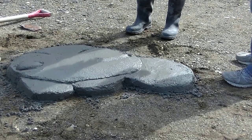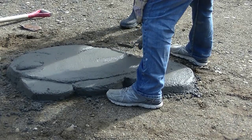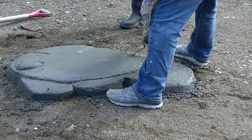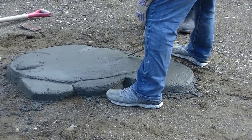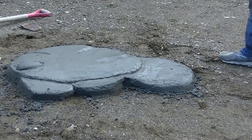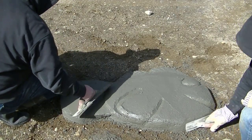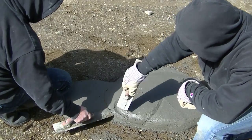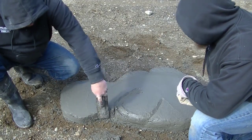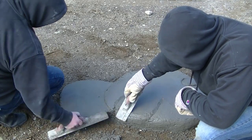They've got quite a bit of time — it's not that warm out today. It was probably in the 50s when they were doing this, so the concrete wasn't drying too fast. They had a good hour to really play with this before it got too dry. They're trying to figure out how to make it look real and add some highlights to make it look like the real thing. Here's a different angle now — you can really see it's starting to take shape. Now they're both using a mag float on it, trying to carve and smooth those edges to look a little more realistic.